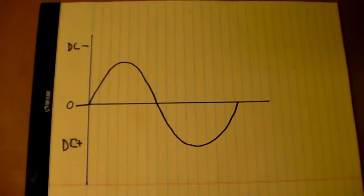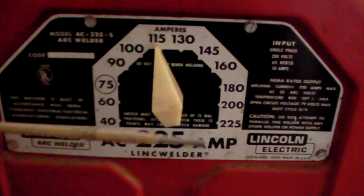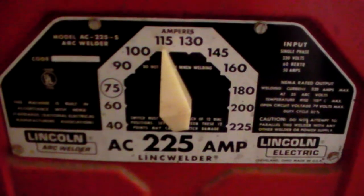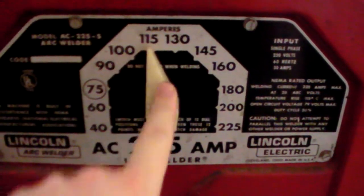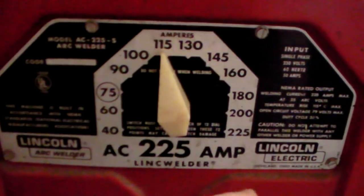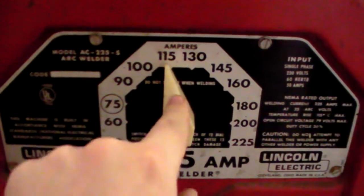Now that you kind of understand some of the basics on AC current, let's go over to the machine, we'll get it set up, and hopefully we'll be running some welds here. The first rod that we're going to set up is our 6011 rod. As you can see on my Lincoln BuzzBox, I have significantly fewer settings than I did on my Everlast — namely, I have this one knob to set my amperage. Simplicity is nice, and the reason these machines last so long is because they are a simple setup like this. With the AC current, because it alternates between the positive and negative polarities and has that zero point, you always need to set your AC current a little higher than what you would set on your DC current.